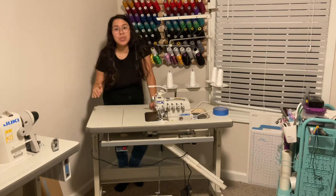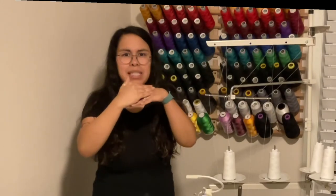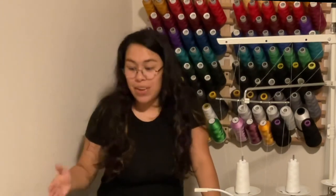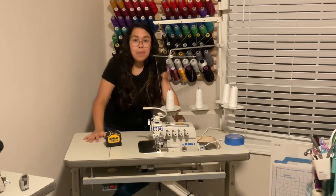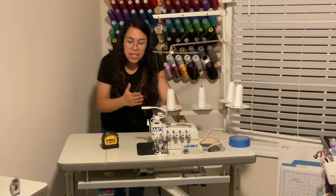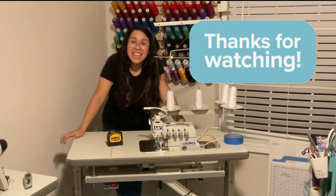I'll put a link in the description for all the tools we used. I am a DeWalt fan, so no promises if your project doesn't come out the same. The table is pressed wood so it has multiple layers — the router gave us problems, so we ended up doing two passes with the circular saw and then chiseling out the little areas we needed to. That worked fantastic for us. This should free up a lot more space. If you have any questions, leave them in the comments below. If you found this video helpful, like, share, and subscribe for more content like this — thanks for watching.